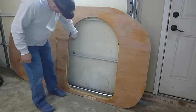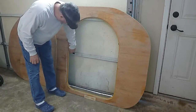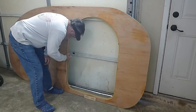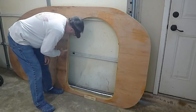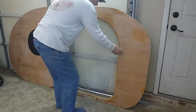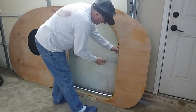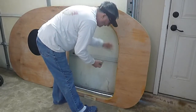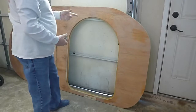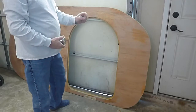You can see where I put on my little lip edge here. That's 2.7 millimeter in between the outside wall. I put in another piece of 2.7 millimeter to move it back a little bit, so when the door shuts the hinges are on this side and it doesn't pinch up right here. You need to have space for your gaskets — a crushed gasket is not going to do you much good. Your gasket is supposed to be squeezed just a little bit.